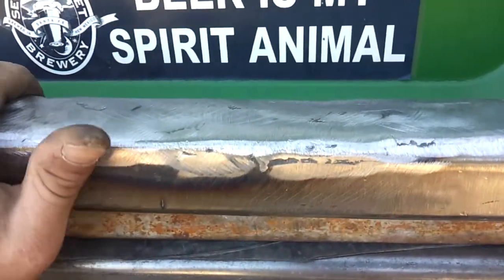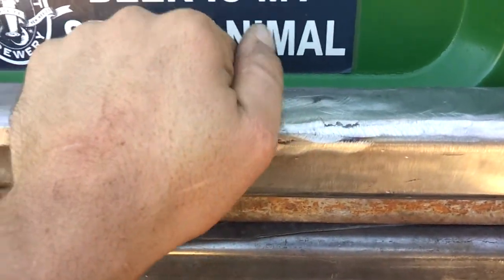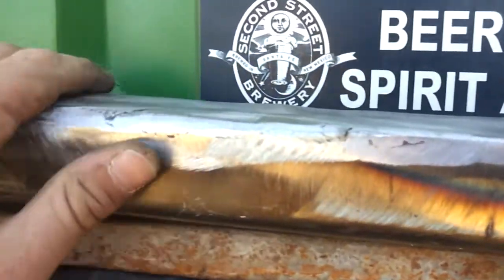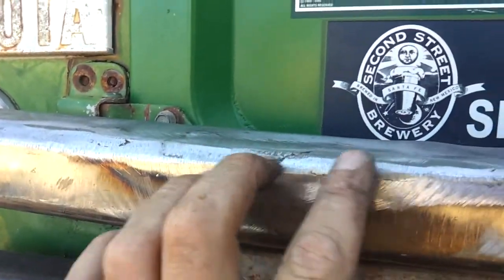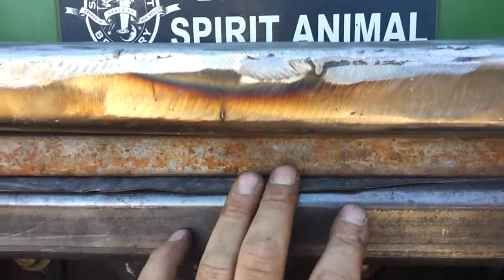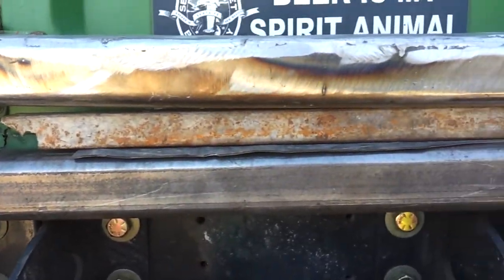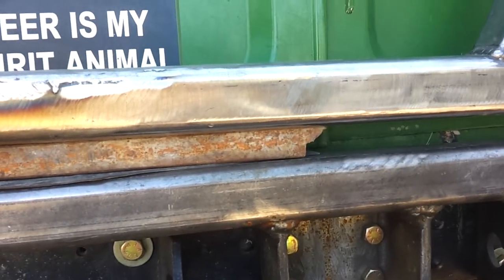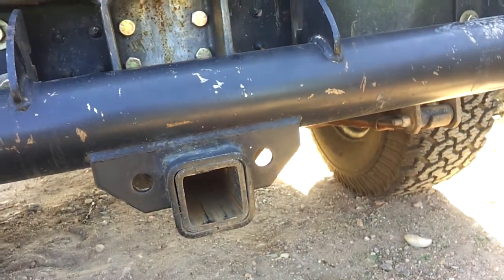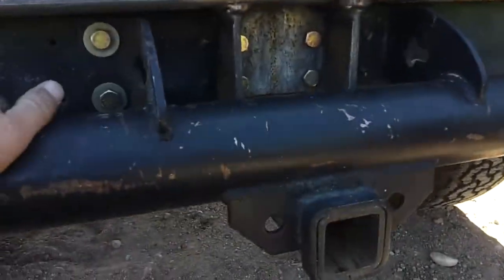I ground and welded and did that about twice — ground, then welded, then ground. I was getting pretty good but it was getting a little dippy in some spots from grinding. I was trying to reinforce those dips by welding on it a little bit more, but I totally didn't even realize it — yep, it completely warped on me. I noticed it when it was hot, stuck it in and bounced around on it, and used a high-lift jack trying to straighten it out.